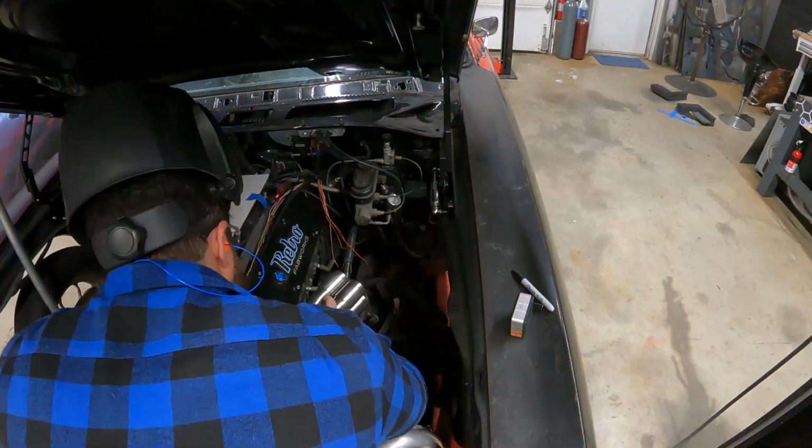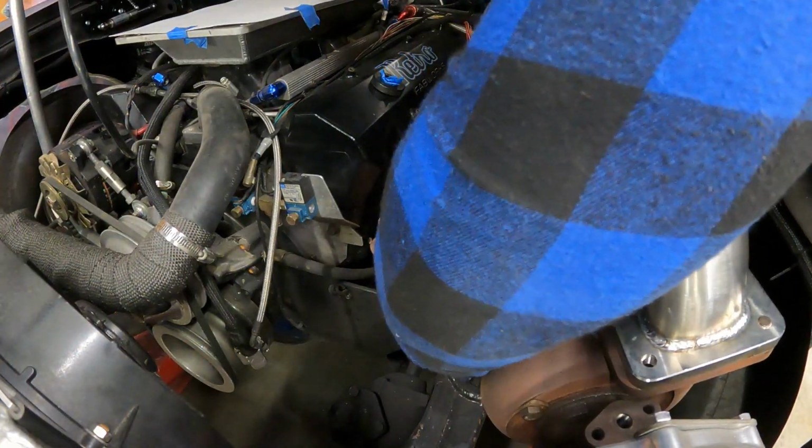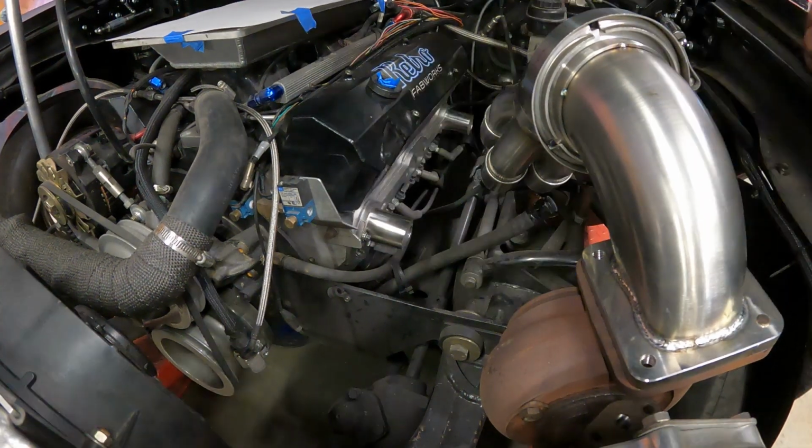The only thing I really did was I put a different computer in it. I upgraded the injectors, put it to race fuel, and then from there upgraded the turbos and I used his stock headers. Then I put a crank signal and a cam signal on it and got rid of the other unit that he was using.